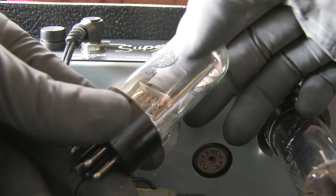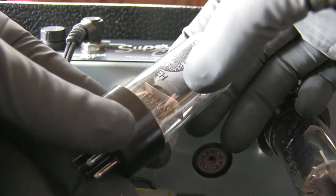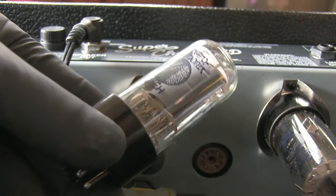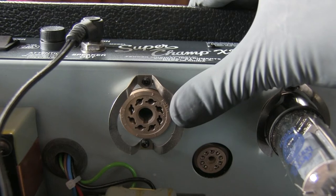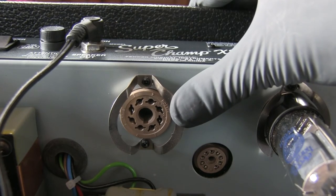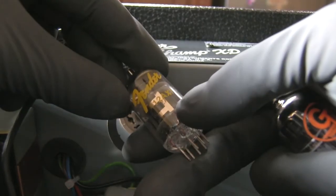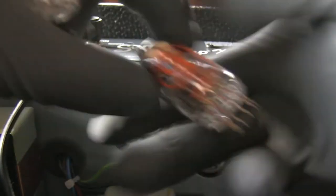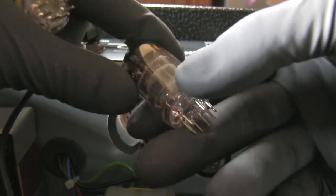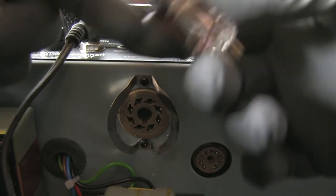There's a slight discoloration on the logo, barely visible. I have suspicions that this amplifier has not been used a lot. Look at that — Belton tube sockets, very good quality; the tubes fit quite snugly. Most tubes in guitar amplifiers are made in China or Russia. This Groove Tube has a marking: made in Russia, 1402. The third source is JJ in Slovakia.